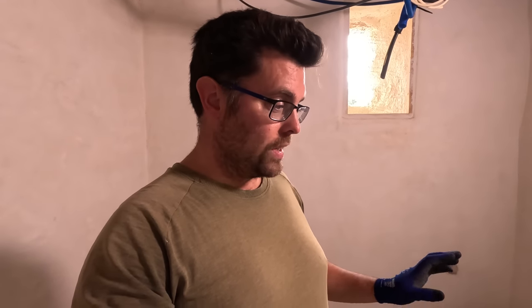The plan for the next couple of days is to be lime washing this room so that we can surface mount all the electrics and the plumbing, so that we can have the heat pump installed in about seven or eight days now. We've done some preparation — given the place a really good clean because there was tons of mess that fell down from when we did the floor project above. We've sealed between the two floors so that hopefully no more dust gets in, and we've given all the walls a good brush down. So now we need to mix up some lime wash.